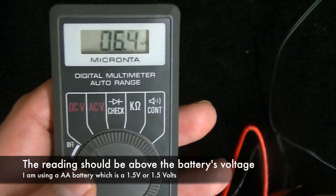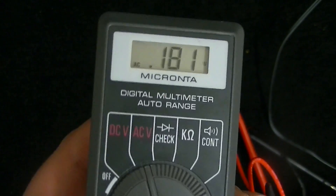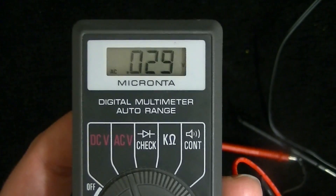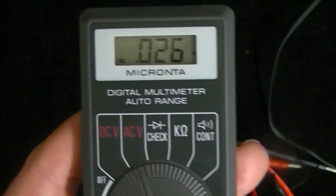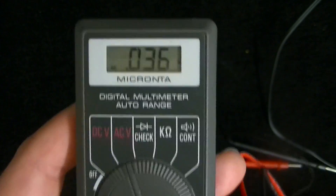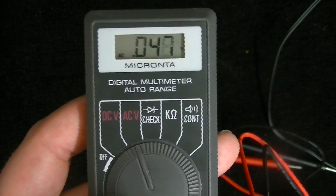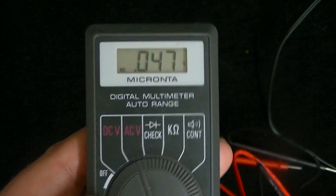The next setting tests AC — alternating current. You probably want to stay away from testing anything like sticking this in your outlets. This particular one is rated up to 400 volts, however there are no fuses in here. Watch YouTube videos of people frying these or talking about them exploding. It may be unlikely, but there is the potential. If you're a consumer-end user, I'd personally stay away from high voltage. Read the manual to know the limits of your multimeter, and unless it has ceramic fuses, I'd stay away from alternating current — that's the deadly current.